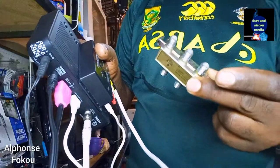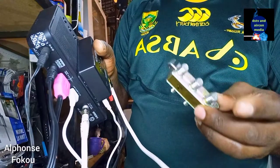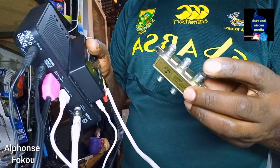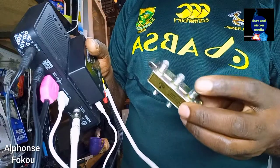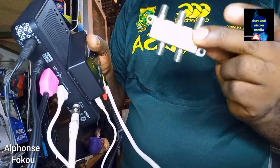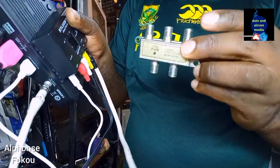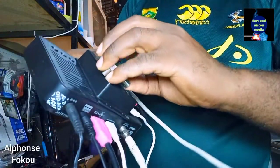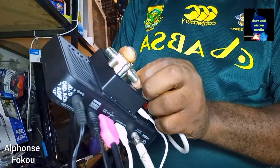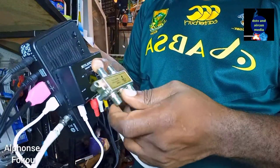Keep in mind: don't make the cable from the multiple switch to your television too long. If the cable is very long you're going to lose the signal and the picture will be poor. I advise you to limit your cable to a maximum of 15 meters so you can have a good picture at the next television. Now we're going to take the RF cable and put it into the input of our four-way multiple switch.